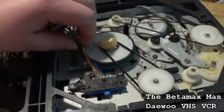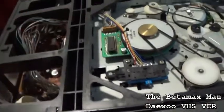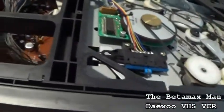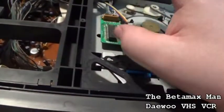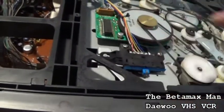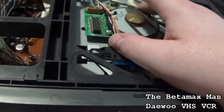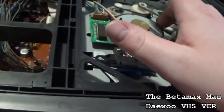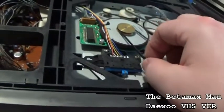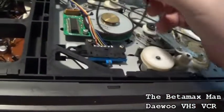I want to change out that electrolytic. I want to test that. Let's just change it. So we gotta cut power here. In order to change it, we're just gonna take our pliers, give it a good twist, and that'll come off, and then we can solder a new cap on there and see if maybe that might be it, because it may not be moving at the right speed. Might have a capstan servo. We do have a capstan servo issue. But like I said, if this belt is too tight, but it does look like this belt might be slipping a little bit too.